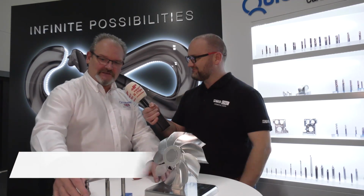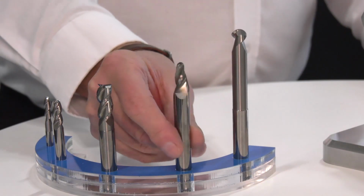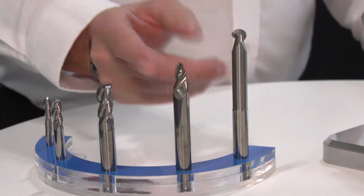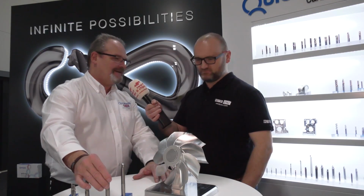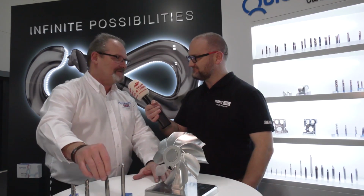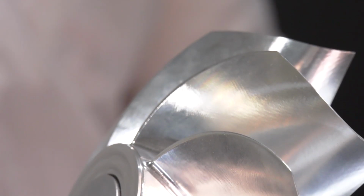Hi. Here we have a blisk, an aerospace part, as you were saying. We're using our latest Cayman high performance cutters to do all the roughing out work. Long nose, ball nose, getting down to the bottom. And the barrel tool is what gives you the quickest cycle time saving. It has absolutely fabulous time saving. So this part is actually just done in 1 hit as well.